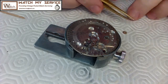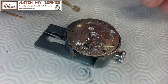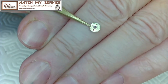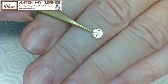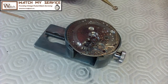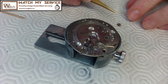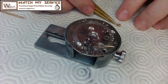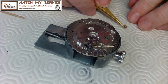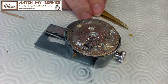Now if I look at that, it should be pretty clean. Oh yeah. So let me see if I can show you the glaze in the camera here. There you go. That's it there. Now you see how clean that is? That's like brilliantly clean. And now I want to see where my witness mark is. So my witness mark is on the other side. So if I grab this like this, this will go down like that. Turn it over like this. It's still brilliantly clean. I look for the reflection again, like I'm saying.